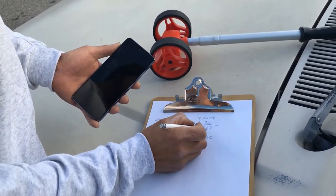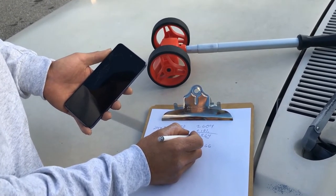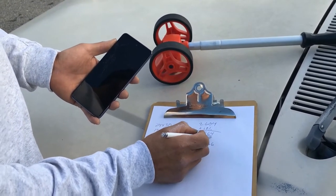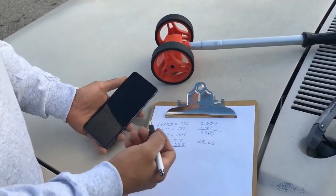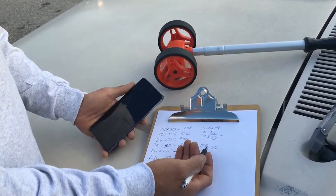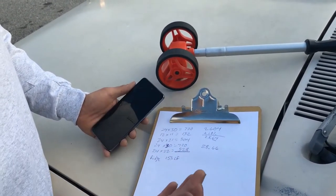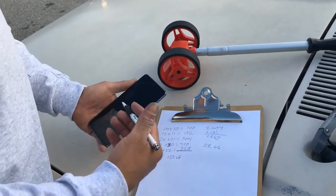If it's a really cut-up roof, we have to add like 15%. That applies more on 12-pitch roofs — 10/12 and 12/12 — because they're steeper, they usually have more valleys, and there's more waste as well.